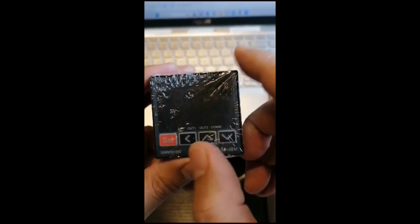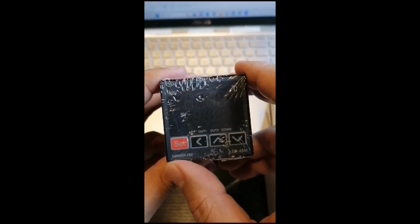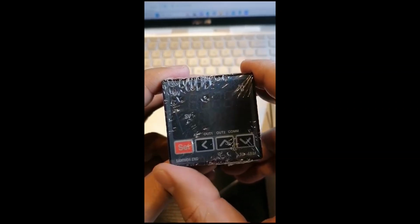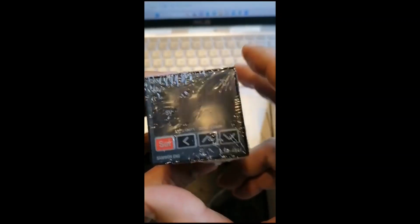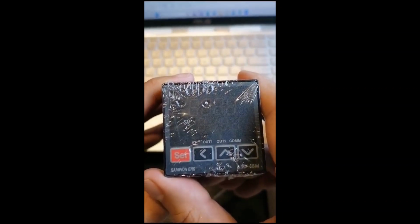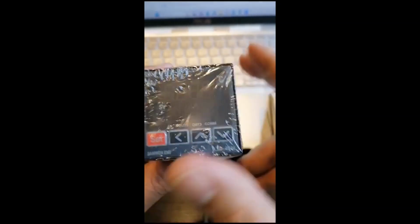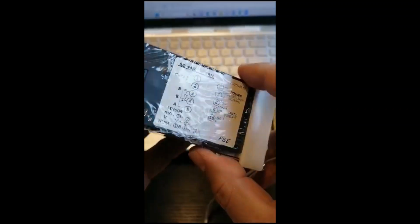And from this controller, you can also set your hysteresis. Hysteresis means this is the distance between on and off. For example, in the hysteresis, you make the value 2. The controller will stop at 10. When the value comes down to 8, then it's going to turn on again.